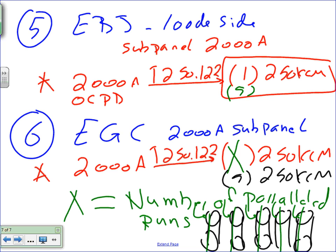Any question? Okay, so that's the equipment bonding jumper. Let's go, guys, to number 7. Any question about this? Really, every run has to have an equipment ground conductor in there. If we have an EMT, we might not need this one. If we're bonding them all with EMT, with bonding bushings and all this good stuff, you don't need to do that. You don't need an equipment ground conductor. But a 4,000 amp switchgear, most likely you pull an equipment ground conductor with it. Number 7.